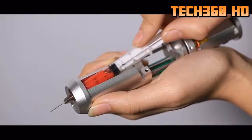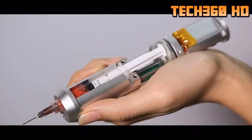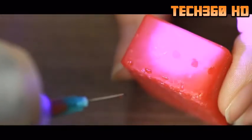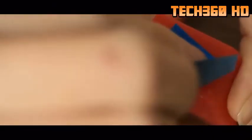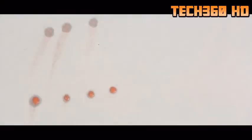The Fixer will control the amount of resin extruded accurately via programmable syringe pump. Tiny resin drops of the proper size will be injected into the defect area. If you inject too much resin, you can use the Fixer to suck resin back into the syringe. After you have the right amount of resin injected, you can cure it immediately using the integrated UV LED light.